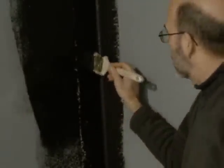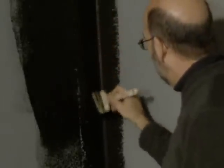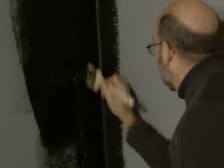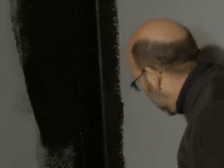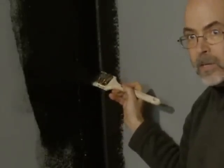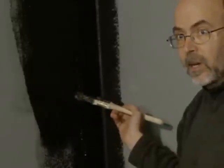I can see that there are some spaces my roller brush can't get into, so I'm going to have to use my paint brush to force the paint into the crevices in the concrete — make sure that that's done. Go back over and push the paint into those areas that are hard to reach with the roller. Once you've done this stroke with the paint brush, go ahead and use the roller brush to go back over that to give it the same texture on your wall.